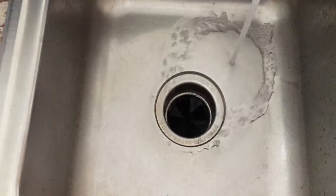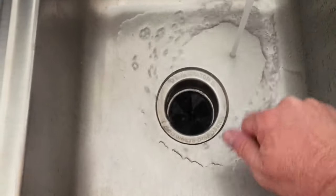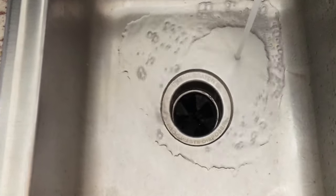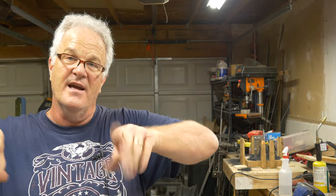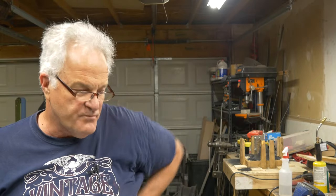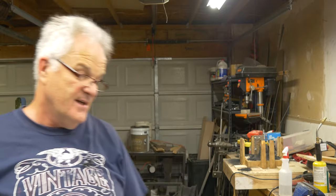And he said that water, as it comes down and hits the sink and flows horizontally, it's the height of the water as it flows horizontally that you need to stop. All right, well, that makes perfect sense to me now. Water comes down, it's going to spread out, or the metal is going to come down and spread out, and we want to stop it before it just leaps over to the top of the sprue. Okay, I got that now.